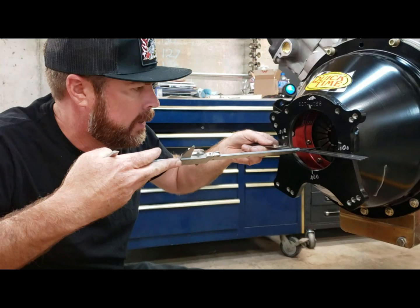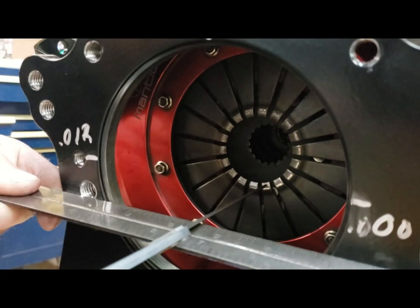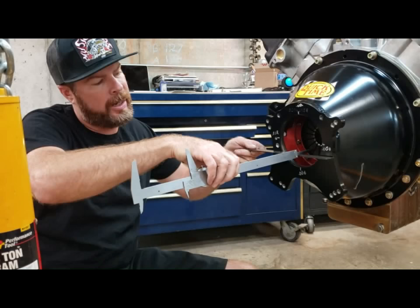In our case, the distance from the highest point of the finger down to the edge of our ruler is 4 inches 195 thousandths, minus an inch for the thickness of the ruler. So remember, we measured from there to there — you have to subtract the ruler — so it's 3 inches 195 thousandths.